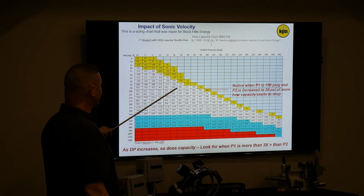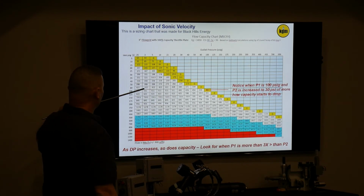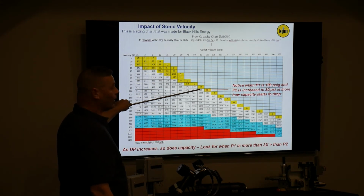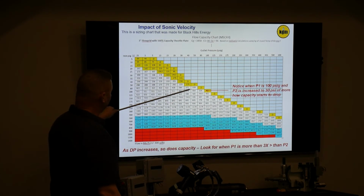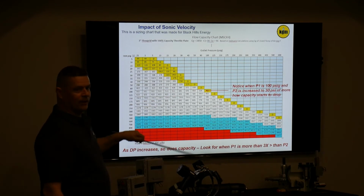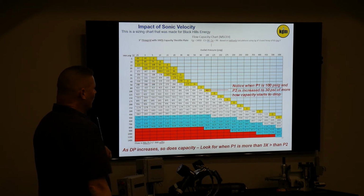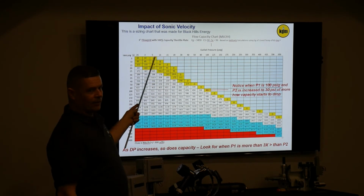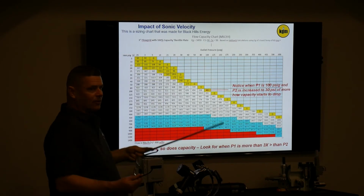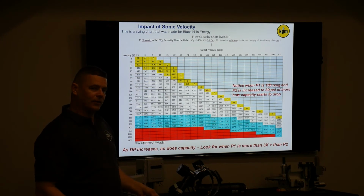Okay, so I'm right there at that point. This valve is starting to lose that critical flow, that sonic velocity. By the time I got really close, within 20 pounds, so I'm making a 20-pound cut from 100 to 80, look, it's all the way down to 326 max capacity. So when we're doing our simplified gas sizing equation, we're not factoring for the outlet pressure yet. That's why it's just a basic SWAG, you know, what do I plug into this formula?